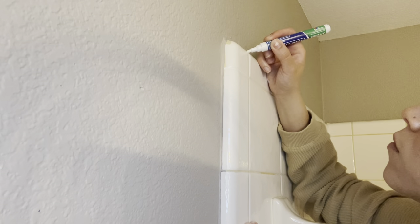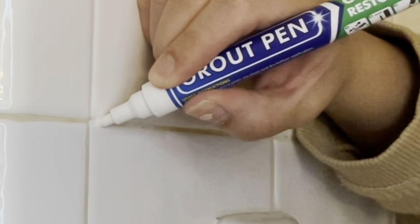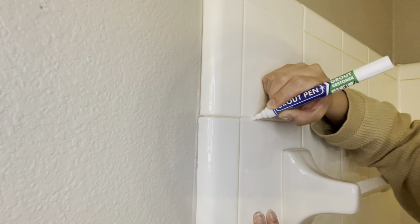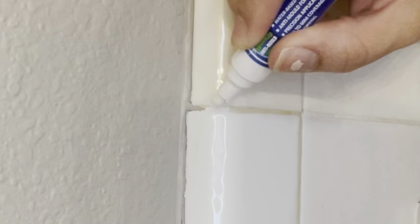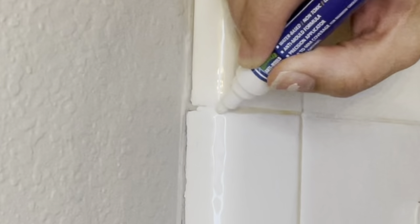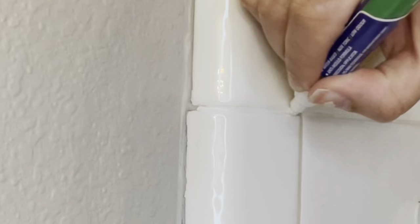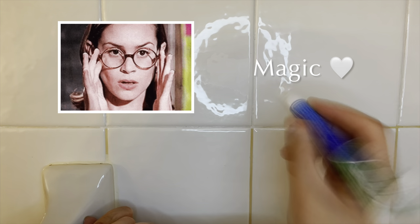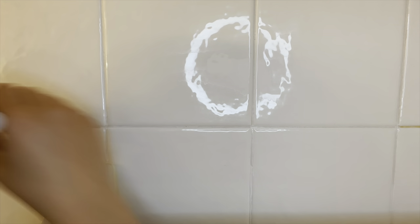Let's talk a little bit about the Grout Pen. The Grout Pen is water-based, non-toxic, low odor, with an anti-mold formula and precision applicator. It says it covers up to 60 meters — I don't know how true that is. It is fast drying. I found that with this method you will need to do at least two coats if your grout is as yellow as mine was. In order to do two coats you need to wait an hour, then reapply. Any excess can be removed with a damp towel.